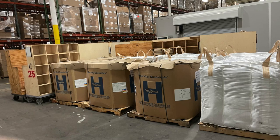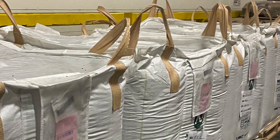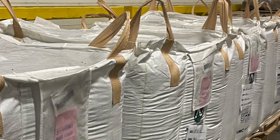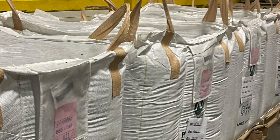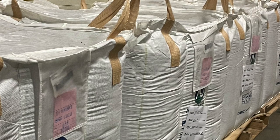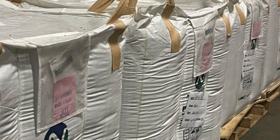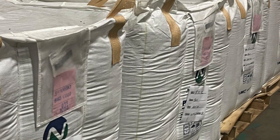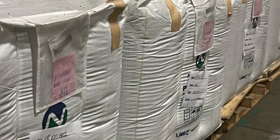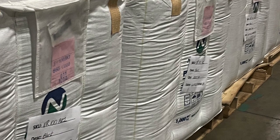We have different pressing notes for each pellet type — they melt differently. Depending on the vendor and the stabilizers, some react softer than others. They require us to run at a lower temperature or different melt and flow characteristics. Every time we identify a vendor we think is a quality vendor, we go through a qualification process — small quantity, medium quantity, large quantity — and religiously track how it performs relative to spec. Once qualified, we introduce them to our supply chain.